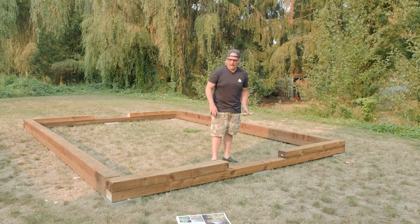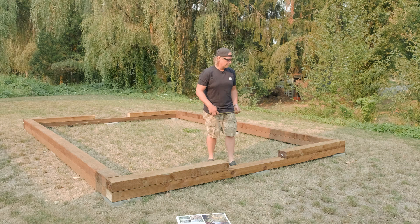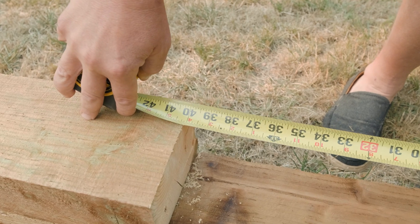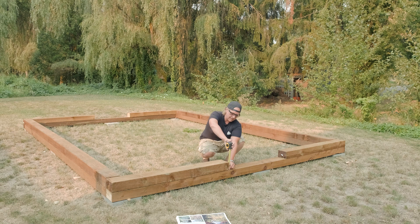When you're measuring doors, you want to check your drawings and make sure you have the proper width, because we offer many different doors and different styles. Just make sure that it fits the drawings that you have and the door that you have. You also want to check your door drop and make sure that is accurate as well.